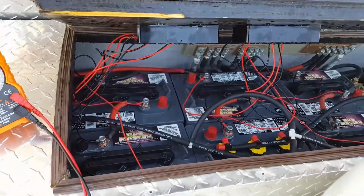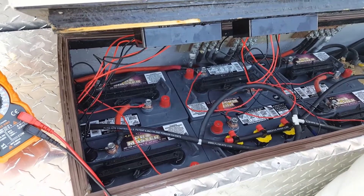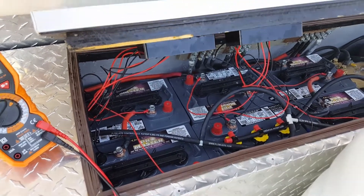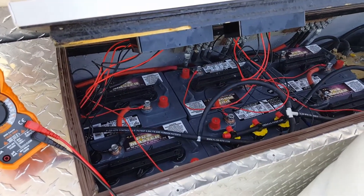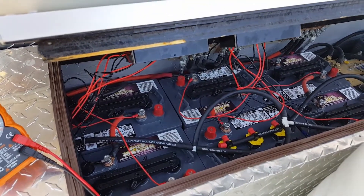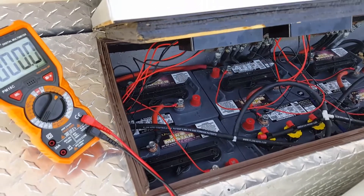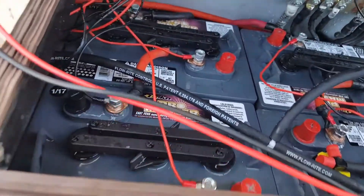I've made observations throughout the day — I've tried about 10-12 voltage tests and I've noticed the voltage fluctuating. Apparently from the equalizers doing their job, like they push more wattage towards a battery that's weaker and they pull from others, and I think that's what I've been noticing. But right now at the latter part of the day, I'm pretty much even on every single battery.